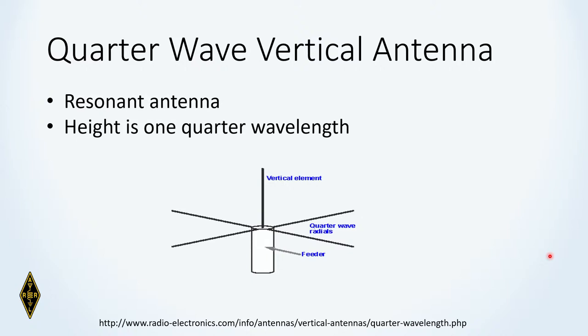Remember those car antennas that I looked at, and we said that they're vertically oriented? Well, they're actually only a quarter of a wavelength high. Well, where's the other quarter of a wavelength? Well, it's the car in that case. The ground plane of the car becomes the other half of the antenna, or you can add radials either on the ground or elevated to a vertical antenna, and this antenna will work as well. So it's a resonant antenna known as a quarter wave vertical antenna with its height one quarter of a wavelength